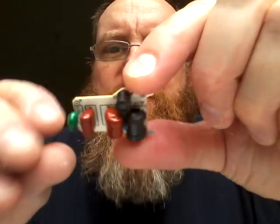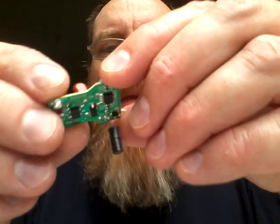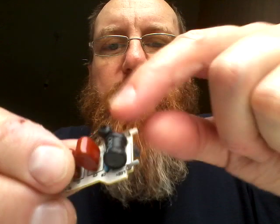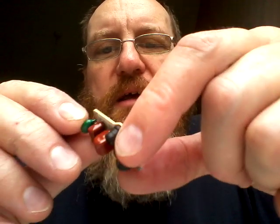Which is looking very much like the classic buck regulator at the moment, just switching the mains down directly through probably this large choke here. This one will be for filtering, I'm guessing. Yes, and there are the filtering capacitors. That looks like a metal oxide varistor, just for suppression.